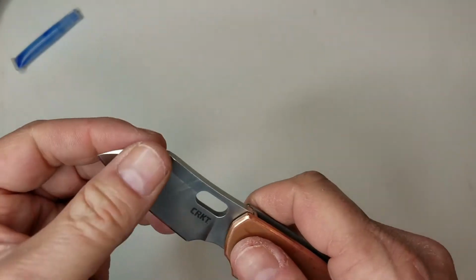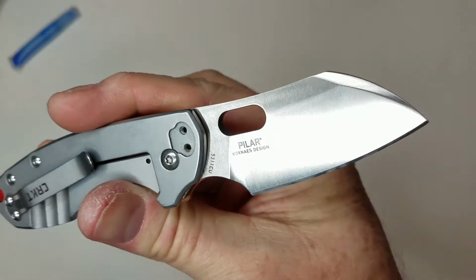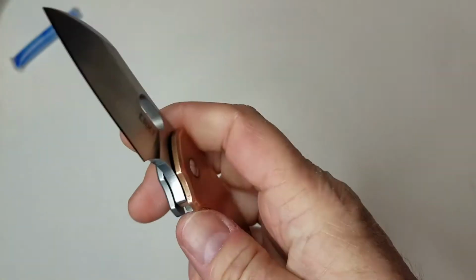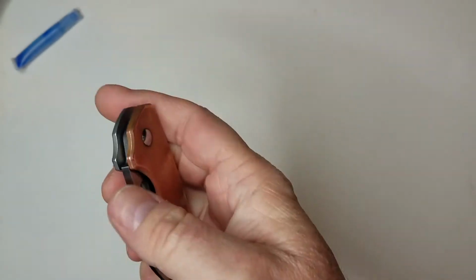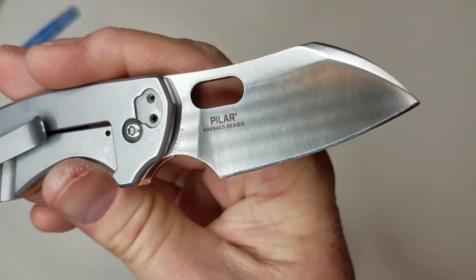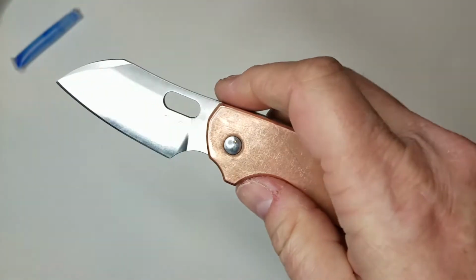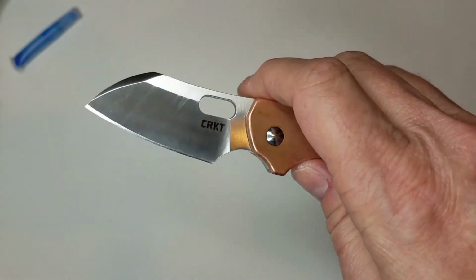Definitely, you can kind of beat up on the blade quite a bit, as I did. You can see scratches all over this one. This has gotten plenty of use in the garage. So in that sense, it didn't chip on me, and I was happy for that because I was able to actually sharpen this thing and re-profile it to a 25-degree angle, so it won't chip, and it lasts a little bit longer, and it cuts perfectly okay.